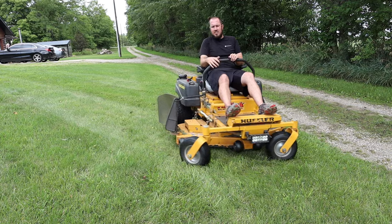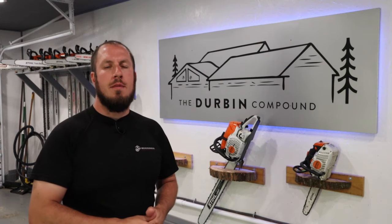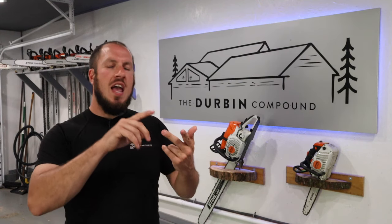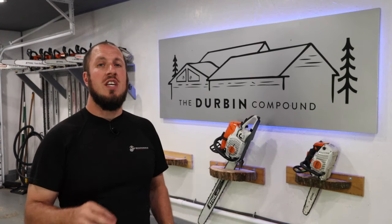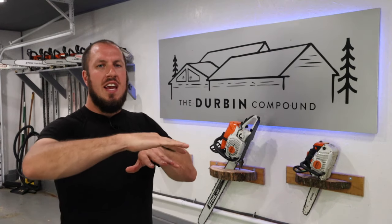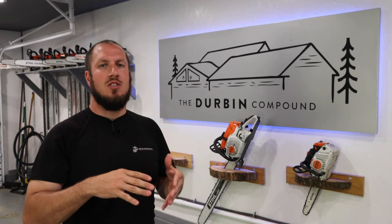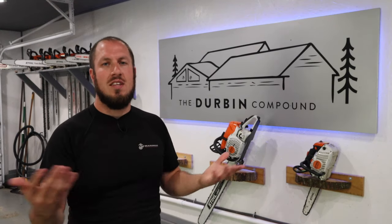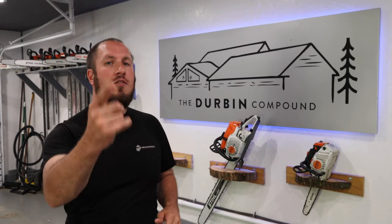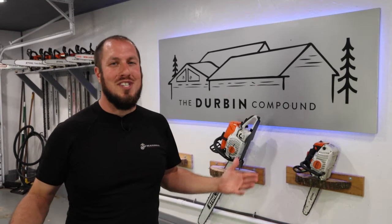So I hope that makes sense and helped someone out. Just make sure, regardless of what kind of equipment you're using — whether it's a stand-on mower, a walk-behind, a zero turn, or a lawn tractor — if you are pivoting that tire in a single place and expecting it to turn in the grass without tearing it up, you absolutely have the wrong mindset. Make sure your tires are always rolling when you're turning, so as to not tear the grass and stir up the soil. Give me a thumbs up or a thumbs down, whatever you're into. If you're subscribed to the channel, we'll see you in the next video.